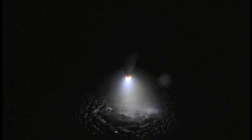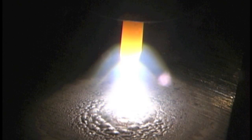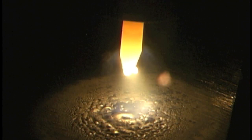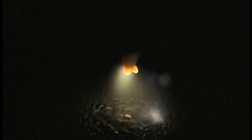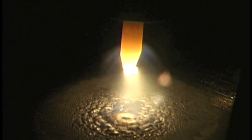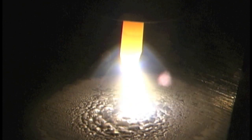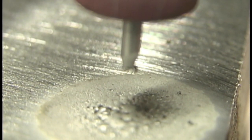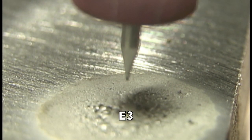Let's try the tri-mix: the lanthanum yttrium zirconium mix. The initial arc start is just fine, but the rest of it is not really. A couple of little nodules off to one side — one of those is going to wind up in your weld a lot of times, or it's going to make your arc unstable. I'm going to pump it up again to 200 amps and see if it rounds and stabilizes and makes a rounded tip rather than that nodule, but it didn't. Some of this is kind of like voodoo — who knows why it does what it does. That one didn't seem to perform too well.